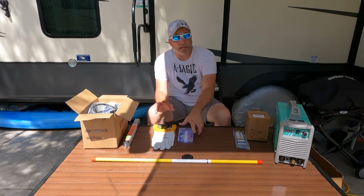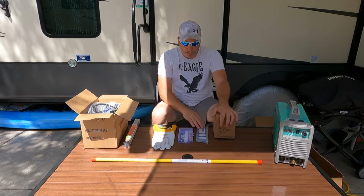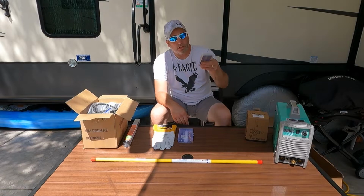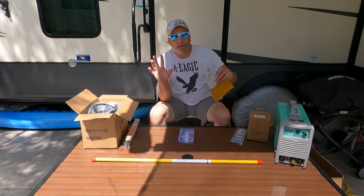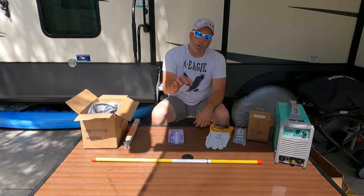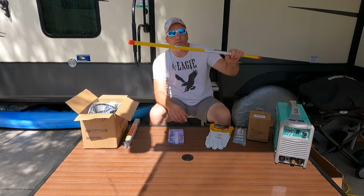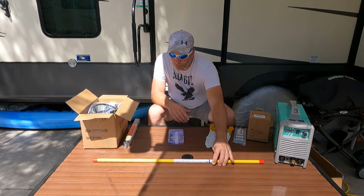So that's pretty much, besides that and the gas, you're going to need, tank's too heavy, I don't want to bring that out, but you're going to need the gas, the regulator, your tungsten tips, and gloves, and a helmet. That's what you're going to need to get started. And then you could practice on a piece of scrap to get the weld pool right before you go add in filler rod. But then you're going to want to pick up some of this for whatever job you're doing, stainless, regular metal, whatever you're trying to do.